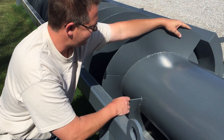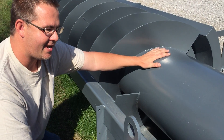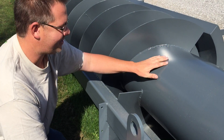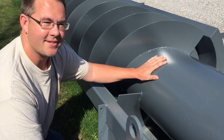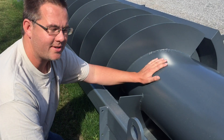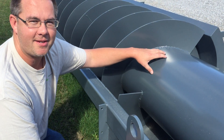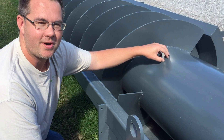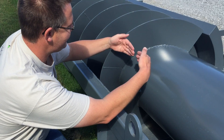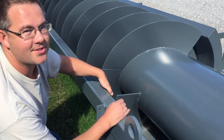The inner diameter of the screw is usually sized for the amount of deflection over the length of the screw. In this case we've got a very long screw — 24 feet long. Since we have to span that 24 feet, we had to make the center shaft 18 inches in diameter. This is a three-eighths thick wall tube so that the center of the shaft does not deflect and the flights don't come into contact with the trough.